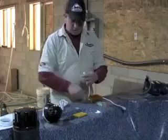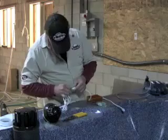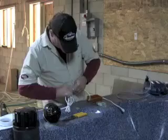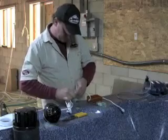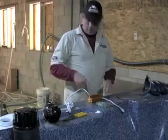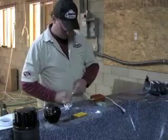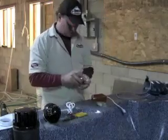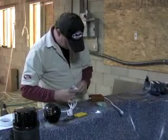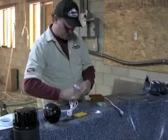So these have light plugs to go in. They're just little 2-prong plugs. So that'll plug in there. So you're going to come off the cell through this plug. Probably be a good idea, doesn't hurt, never hurts, because we're dealing with the salt water and corrosion, so put a dab of dielectric grease. We'll thread that in. This will be underneath the spa.